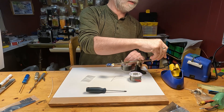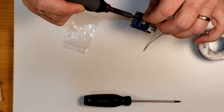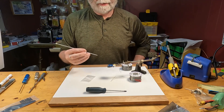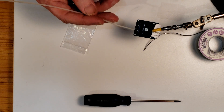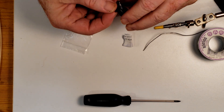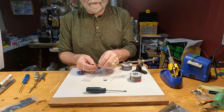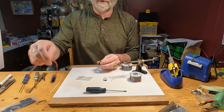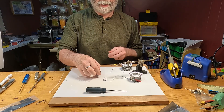If you're getting too much of a blob, just clean it off. After you've done that, check between each pin to make sure there hasn't been a solder bridge formed between any two pins on the bottom. Then we pop this off and we can see that on this side it's now mounted very securely. If we take a servo lead, we can now simply plug it in and unplug it, rather than having to do soldering every single time we want to add, remove, change, or replace a servo.